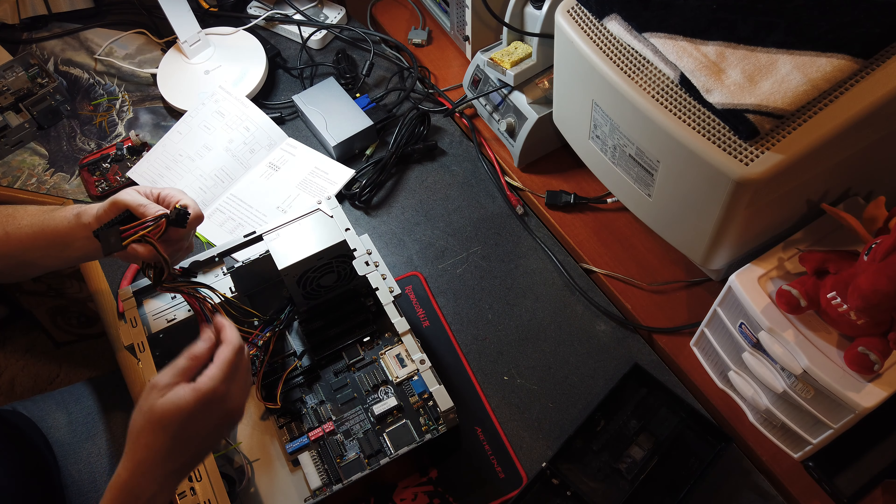Selected boot menu. That does not look correct. Let's power back off. I am a little concerned - when I plugged the power supply in, it sparked. I'm worried it did something bad - it might have cooked my compact flash card, which would be really, really annoying.